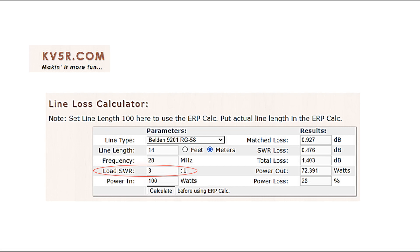That could be acceptable if you're using antennas with a narrower bandwidth than the band you're operating in — like a 28 or 50MHz beam may not cover the entire band. Your VSWR might be say 3 to 1 near the band edges. You could use an antenna coupler, even at the transceiver end, to address minor mismatches. A small amount of extra loss, but since we're staying within 1dB to start with, the extra half dB is probably acceptable.